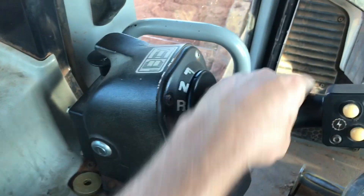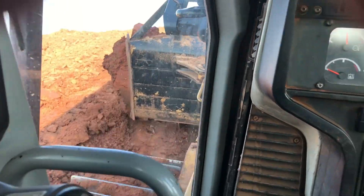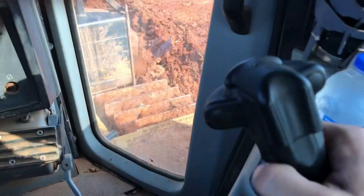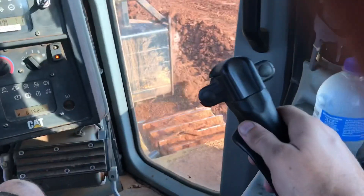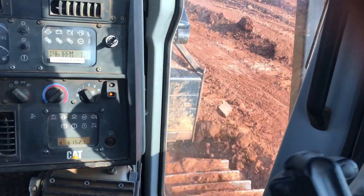Apply the brake just slightly coming down the hill. Throw it in forward. Kind of hard with only one hand to do this. Try not to steer, kind of dig in. Your RPMs will drop and start moving a little slower. Make sure you're seeing quite a bit of dirt pushing out the side of your blade. When you feel it start to stop, just lift up a little bit. So you can see how much you actually move it. I'm not even touching the steering.